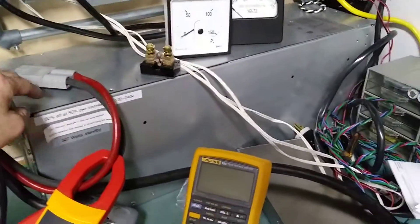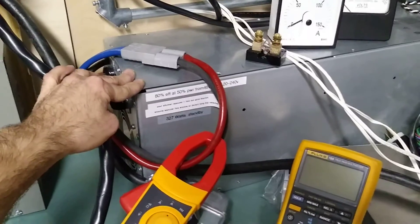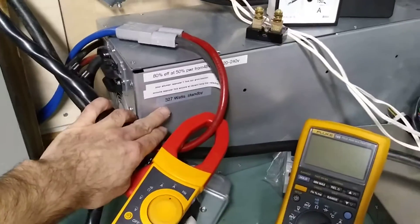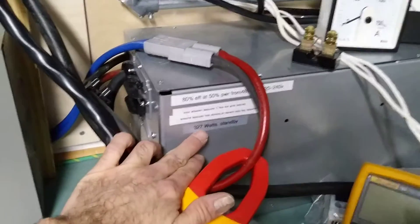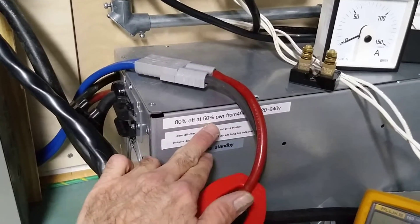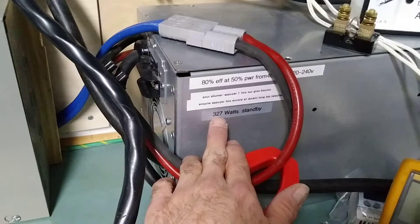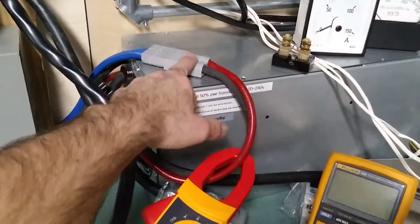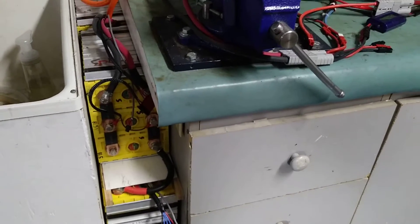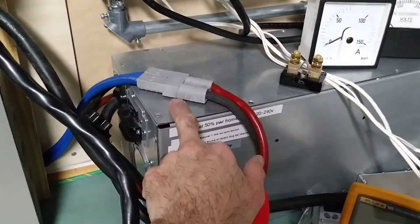Here is the power plant I mean — this is an APC UPS that is 4000 watts, 5000 volt-ampere (VA). It's not very efficient, but I'm using it for emergency situations to power independent things not connected to the grid. It's about 80% efficient at 50% power draw. I have a battery bank here — Thundersky cells all connected together for a 48-volt source — and that DC source connects to this UPS.